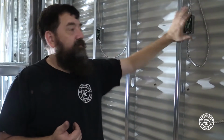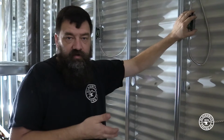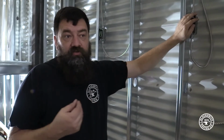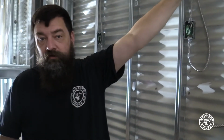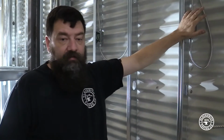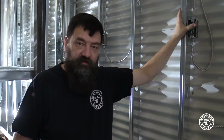If you have a wire that's only supposed to carry 20 amps and you run 40 through it, or there's a short or something, if you don't have the right size wire, you can literally melt your wire and start a fire before your breaker blows. So it's very important that your wire is sized to your breaker. So if I have 15 amp wire, I need to have a 15 amp breaker. And that way this wire can never fail and start on fire.